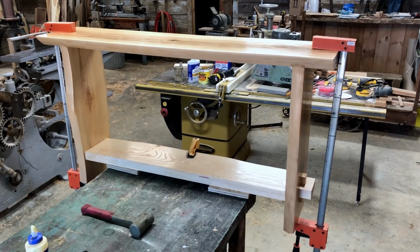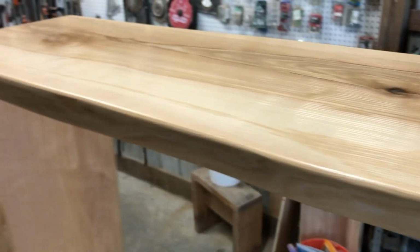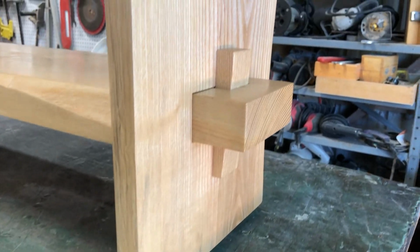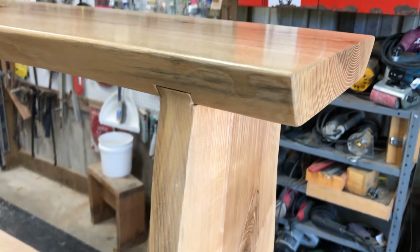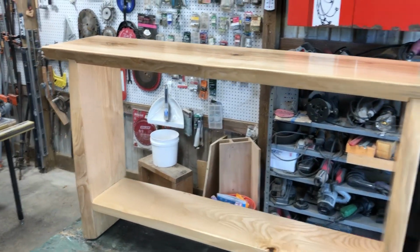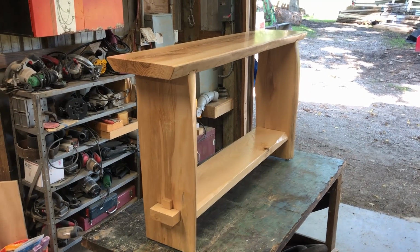The finish I use for furniture usually is French polish. Shellac applied in very thin coats in either circles or sweeping motion. It just gives such a beautiful luster to the wood. You can still see the grain. I generally don't fill in the pores of the wood. I just go over it with the shellac and the French polish process. And that way you can still see the shape of the grain, and meanwhile get a high gloss finish.